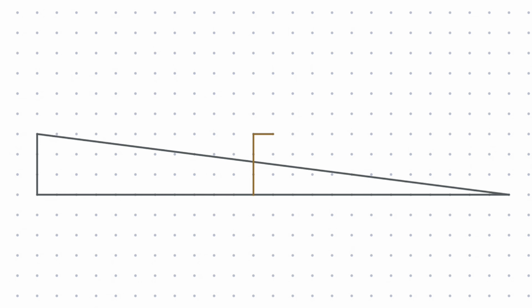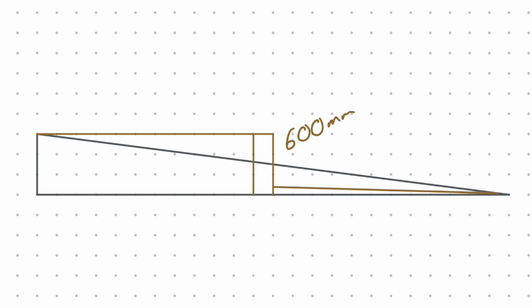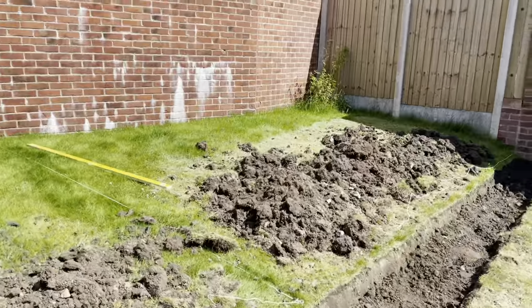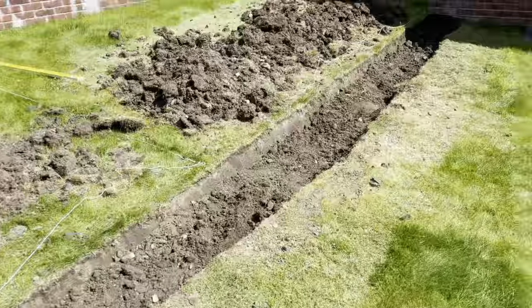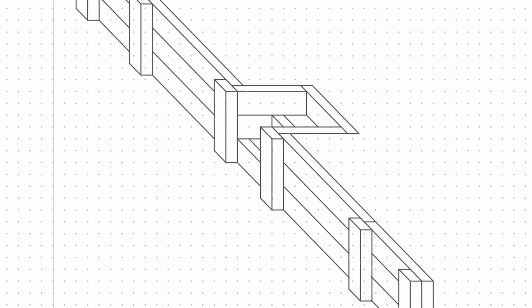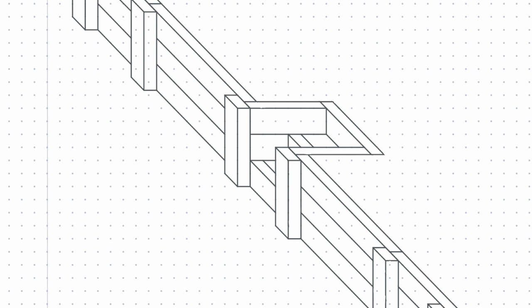I decided that I wanted the post to be around about halfway across the garden. The difference between the front and the back of the garden was 600mm, so that told me I needed to bring the top layer up to that level. I looked at a couple of different designs — my first design had the posts behind with a flat aesthetic, but I soon realized it made more sense to have the support posts at the front, as they'd be holding the weight of the sleeper wall itself and would give more structural integrity long term.